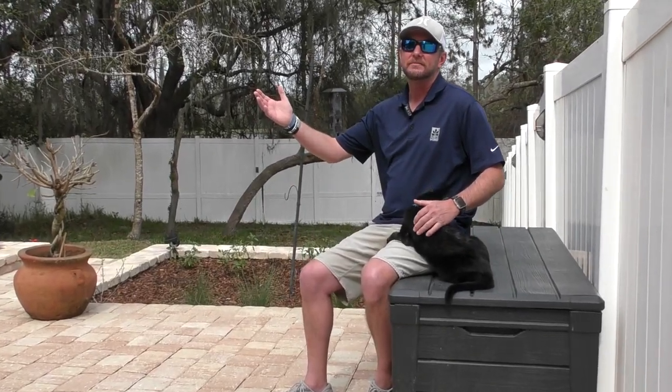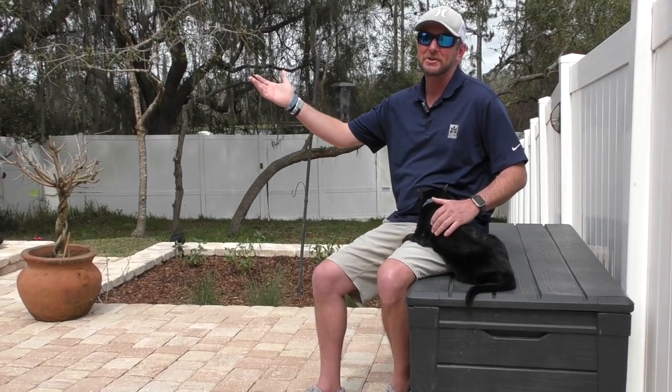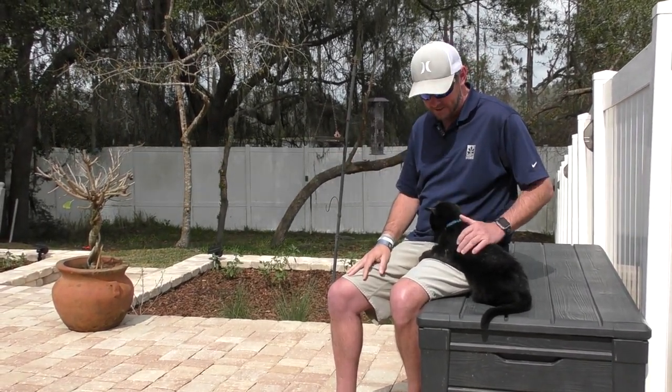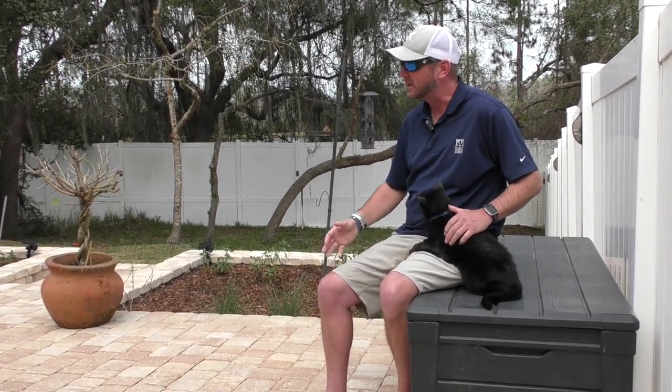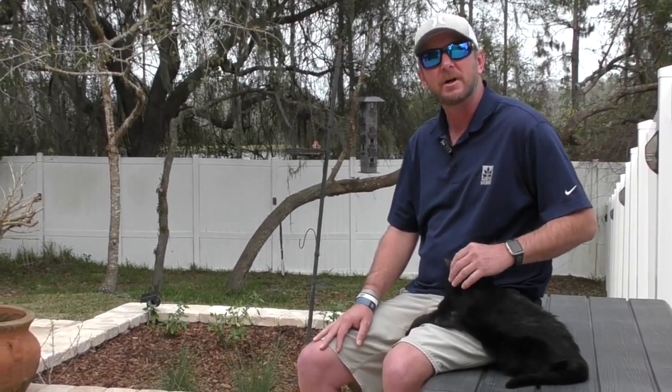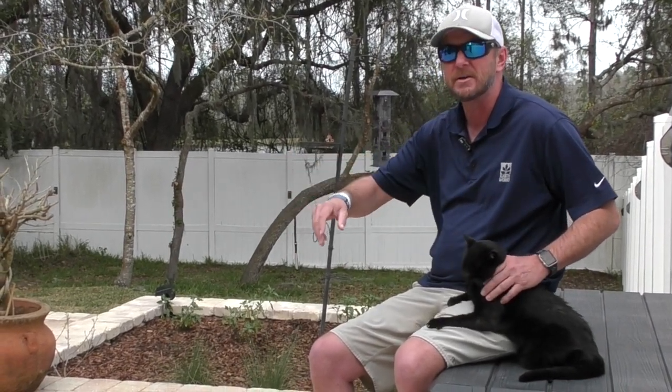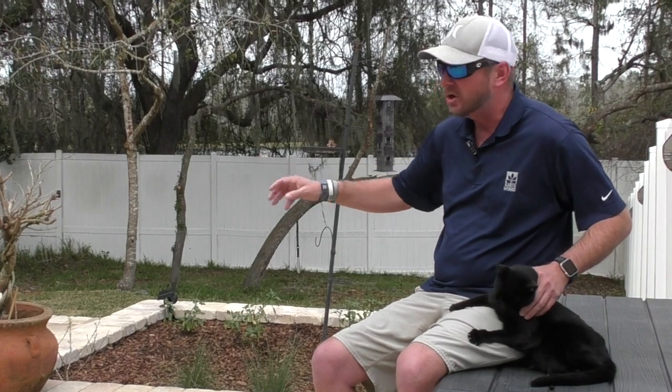So you heard it from the client — call Mike, Mike can do it. In all reality, we're here at the final job and Watson approves. He's got his two new litter boxes and he's happy as could be. The clients are super happy. I'll be reaching out to the client later this week with an estimate for polymeric sand and sealer for the pavers. We're going to do the entire patio, so it'll give it a wet look instead of this chalky look we currently have. The polymeric sand will also help prevent weeds coming through and any insects that may want to crawl through.